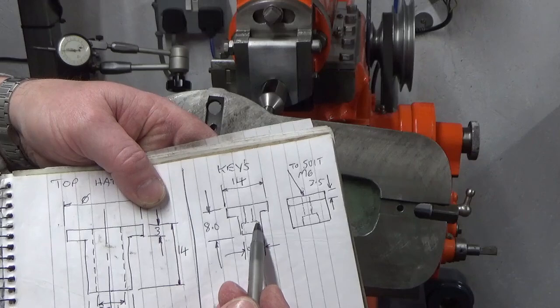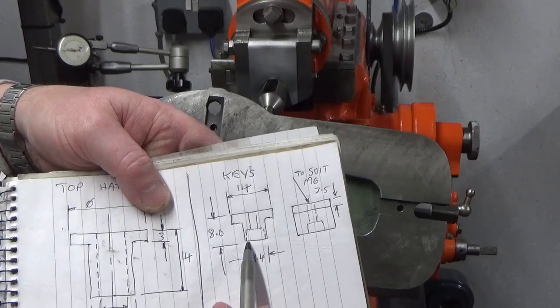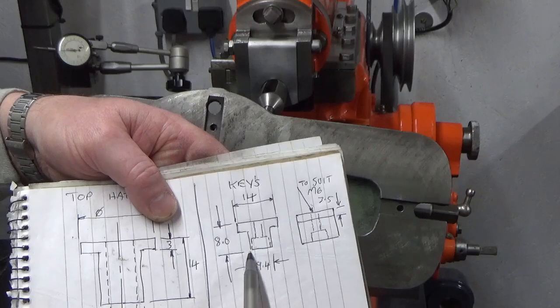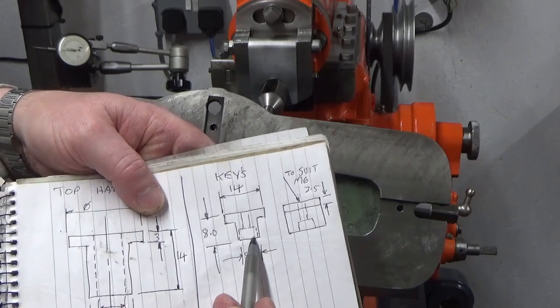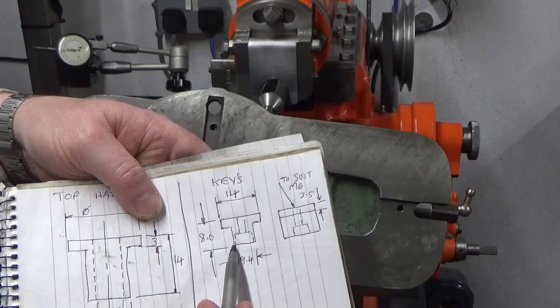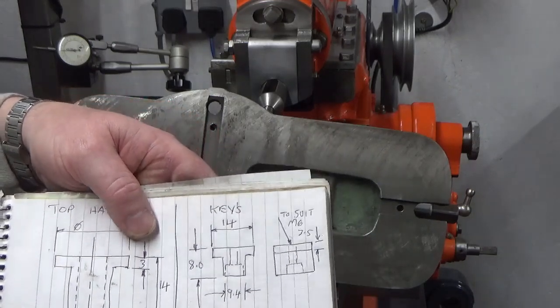I might just pop a couple of cap heads up in the lathe and just turn the head down to get myself a little bit of clearance, meaning I don't have to counterbore so deep, or I could just countersink the bottom and use a countersunk screw rather than a cap head screw. And if it slightly protrudes each side, we can just tidy that up, we can just take a bit of that material off as well. So I've got options around that.